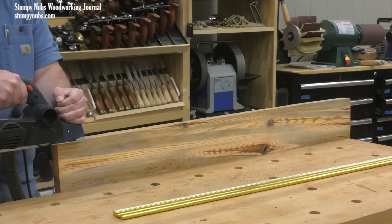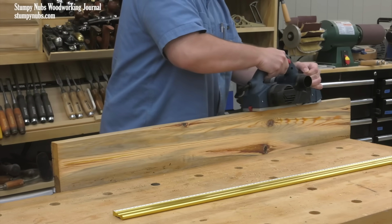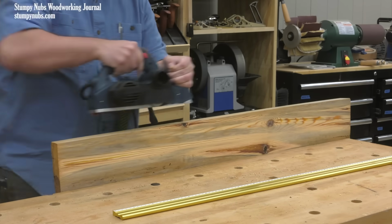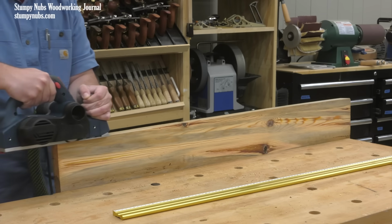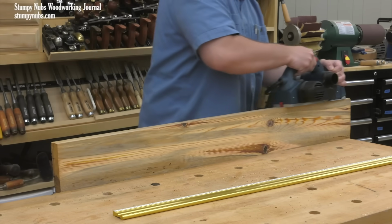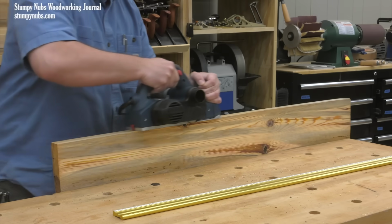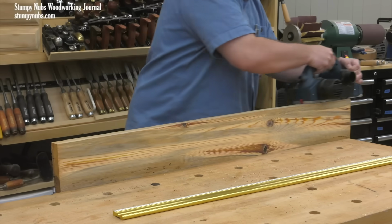on a table saw. The same process may be used to straighten a hollow edge where it curves in the opposite direction. In that case, you would take short passes on each end, which grow longer and longer until the entire edge is planed straight. Keep these techniques in mind as we move on to the face of a board.